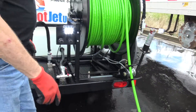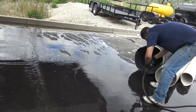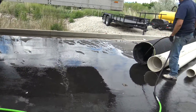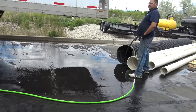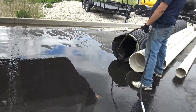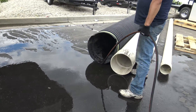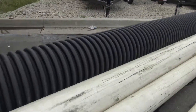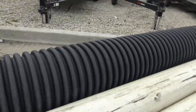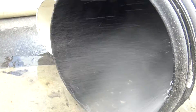Jetting reel off, bypass, turn your throttles down. We're going to go ahead and put this down the 24-inch culvert so you can just see the pulling power inside of a bigger line. We're ready to jet — throttle up a little bit, switch your valve on, and we're jetting. Even on a 24-inch line you've got quite a bit of pull. That's got the Warthog WS nozzle on it — hard-working nozzle.